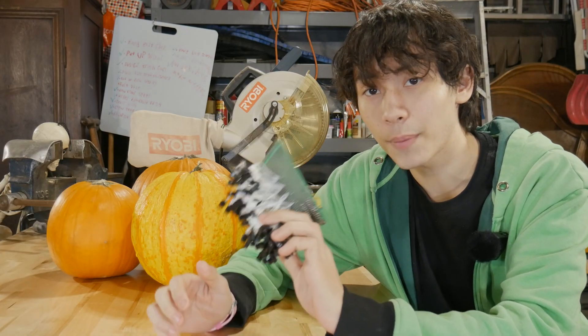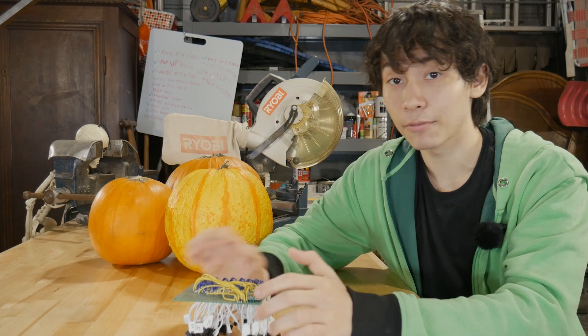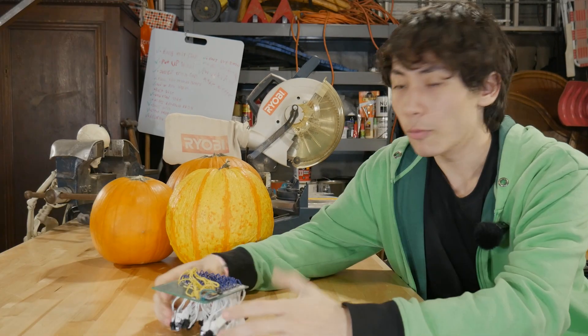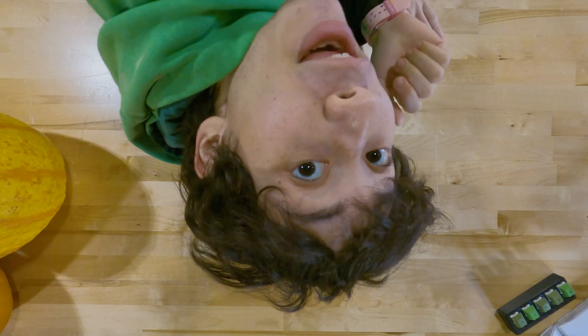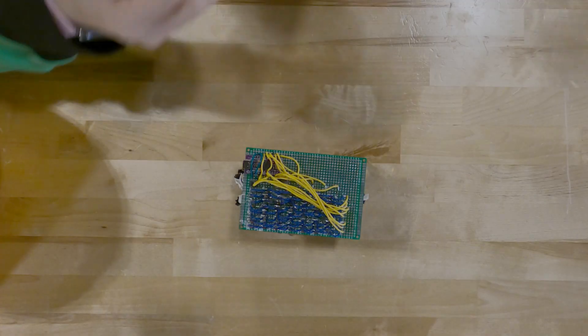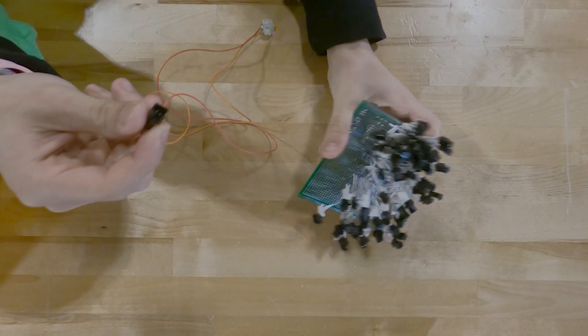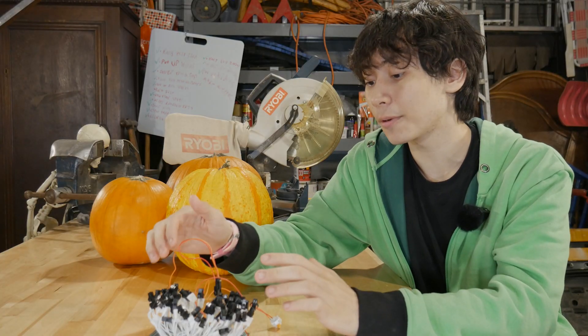This is a larger version of a button matrix. It has room for all 54 keys, plus two additional keys I'll be using for shift and escape. The Malling-Hansen Writing Ball was produced in 1860 and so did not originally have these keys. I've designed it so that all I have to do is attach the switches using locking connectors on the back of the button matrix. It'll still be wired up as if directly soldered to the circuit board, but this gives me a little extra room to play with.